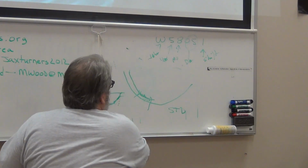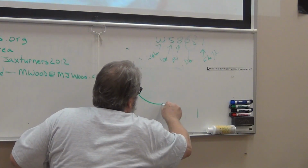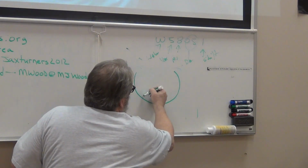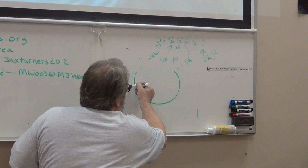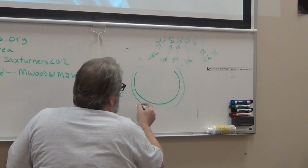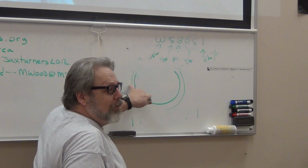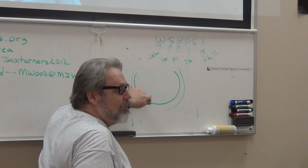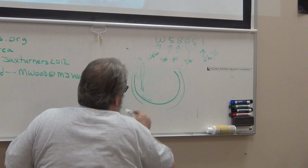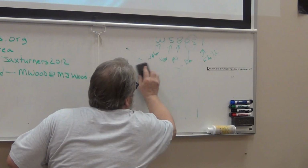For a bowl like this, that's not critical. For a calabash, you betcha. Because you can't get your gouge in this area. With a conventional grind, you can't get it in and have your handle not run into the upper rim of the calabash. So having something allows you to come more straight in and still have an angle to go across. That's why I have one of these.